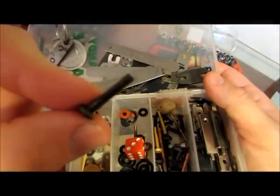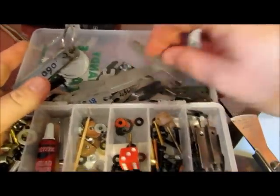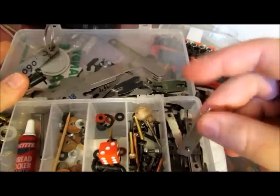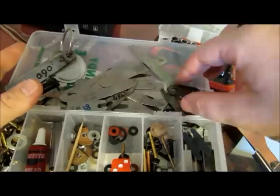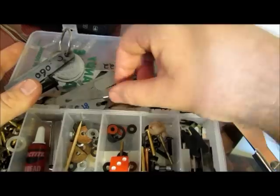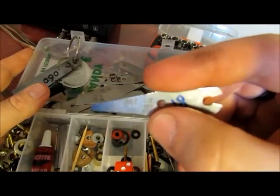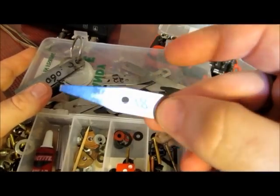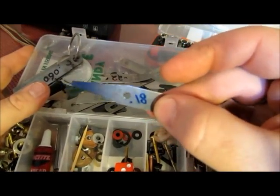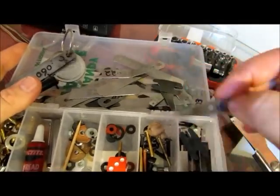You can keep screws for your coils and then a bunch of springs and armature bars for when you need to switch out a spring. If you're cutting springs out of feeler gauge stock, try to leave the numbers on there. If you don't have a number on it, just get a marker and mark what that is — because if that rubs off and you don't have the numbers, you're going to be guessing what size spring that is.